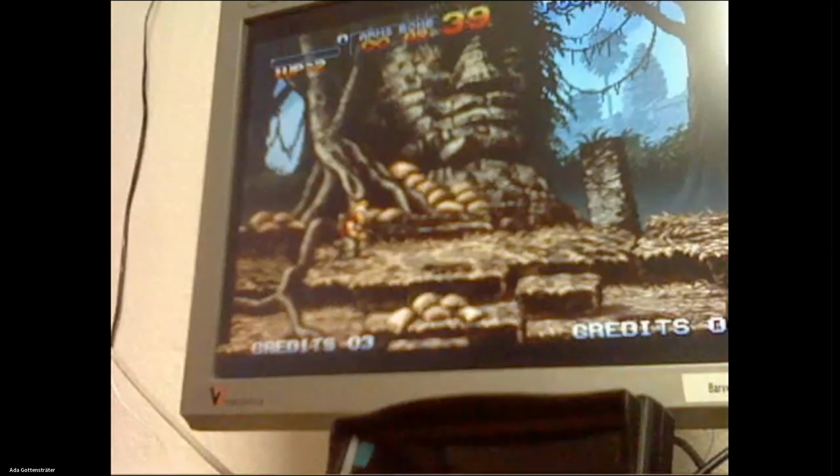Of course, you can do a lot more than the old computers used to do. For example, I don't have this ready to load right now, but I've done one that can draw vector shapes on the P1, mind you. So you have 60 FPS full screen, everything vector graphics without a frame buffer, which is kind of unique. I also have a P2 version of that, where it can run in crazy HD resolutions. But I haven't messed with that in a while.